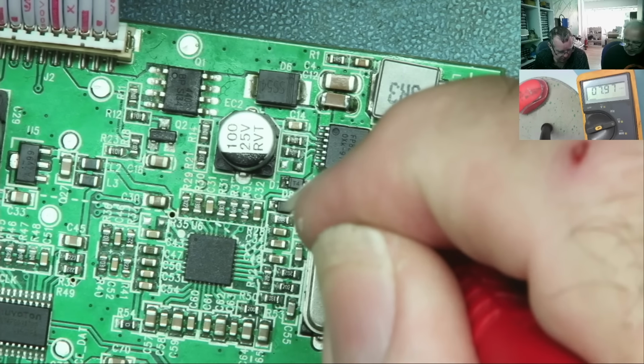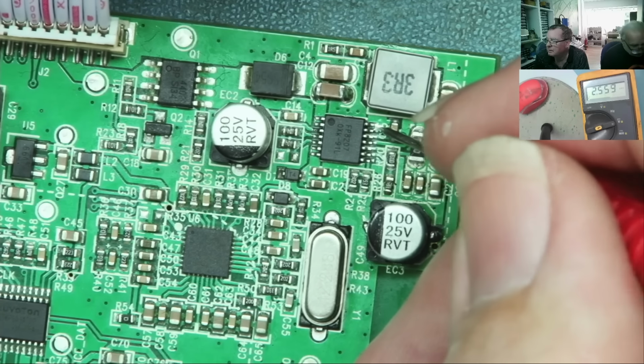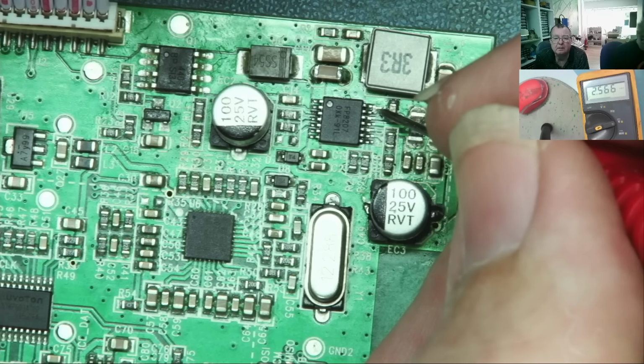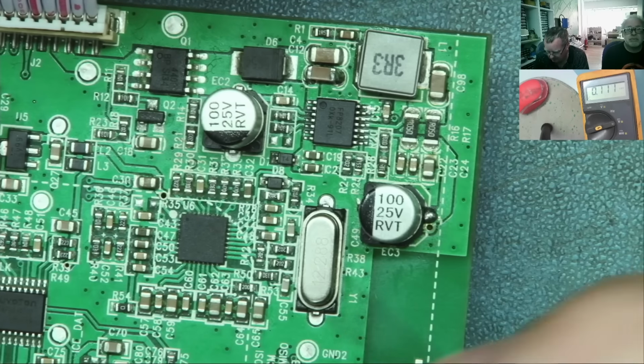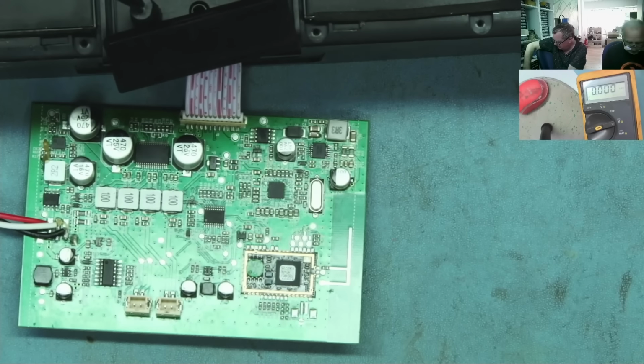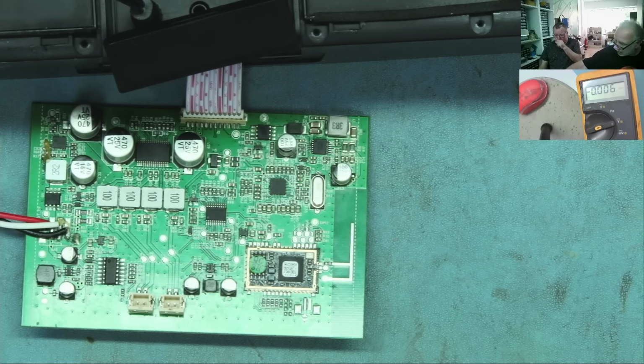Something's really, really wrong here, though. The battery doesn't show me anything. Maybe there's a protection circuit somewhere. Well, it still has 2.5 on there. Do you still have the leads from the current supply? Yeah, I certainly can do. Can you jolt this with a little thing? If there's a protection circuit in there, I simply want to get the protection circuit back to operational mode. So red ones, push, yeah. Please go. Okay, working. It's charging. Good. That's all. I don't need more.